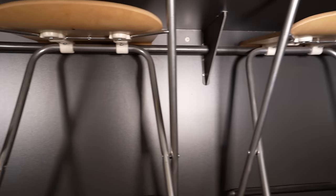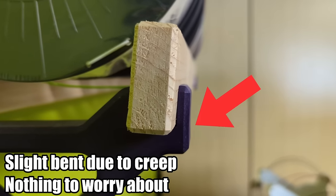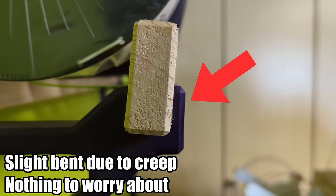My general experience from years of everyday usage is that PLA parts are usually stronger than you'd expect. I never had any part break unexpectedly — even my kitchen counter and bar stools hold up perfectly fine after 5 years. One thing to add: PLA is susceptible to creep, so if you plan to screw parts together, remember not to overtighten them, otherwise the parts will deform and the screws become loose over time. It also doesn't like to be cut, sanded or drilled. You reach the point where the material starts softening due to heat pretty fast and you end up with a deformed part, so if you plan to do any kind of post-processing, you'd rather stick to other materials.